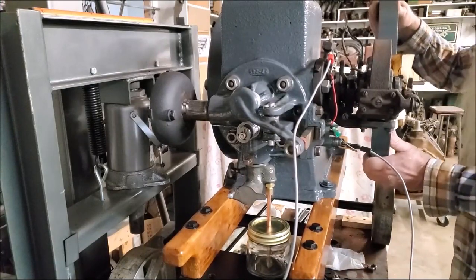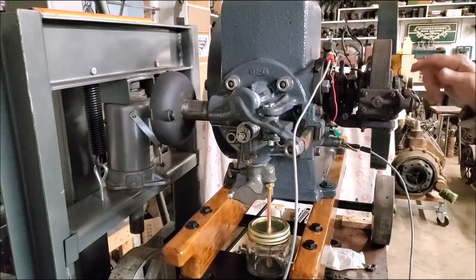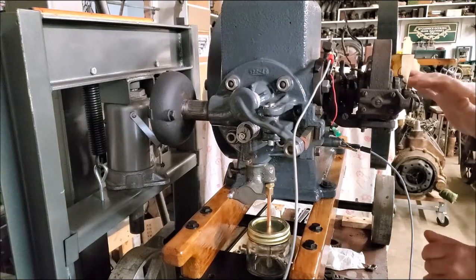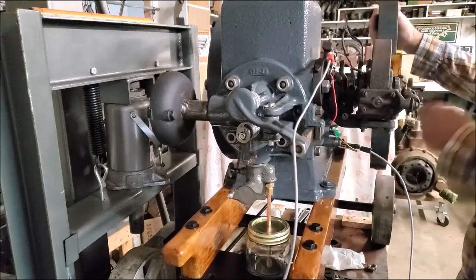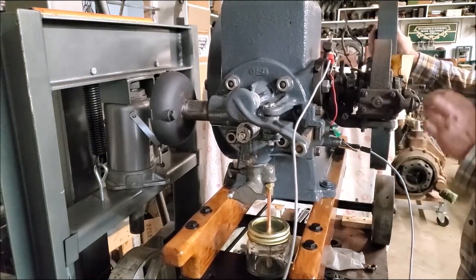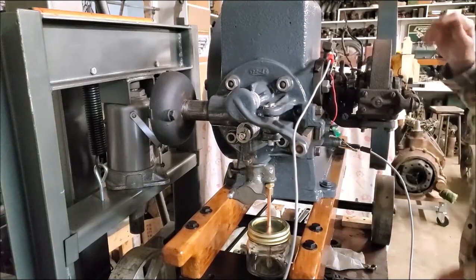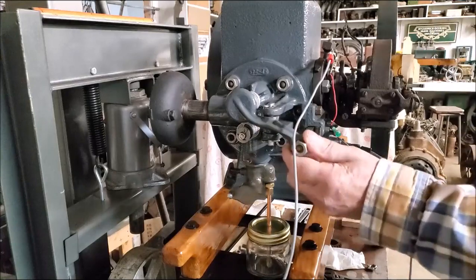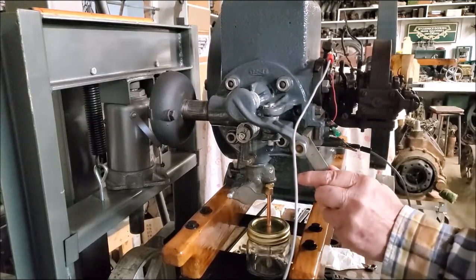Okay, see it started right there - we're right here going out, and that valve's full open right there. When it comes all the way around a half more turn right here, that should be fully seated. So when this crankshaft throw is completed to the front, indicated by the keyway and the crankshaft relationship - let's get it to where we think it should be. Yeah, see, we've got that sixteenth again. So it went through that sequence - that's pretty good.